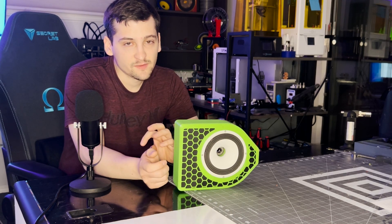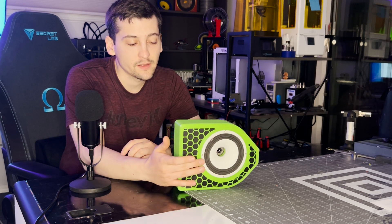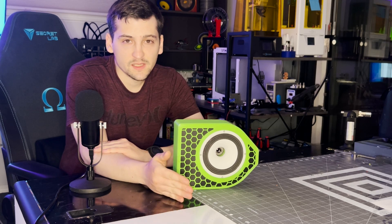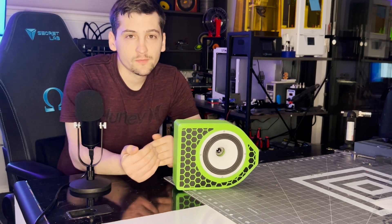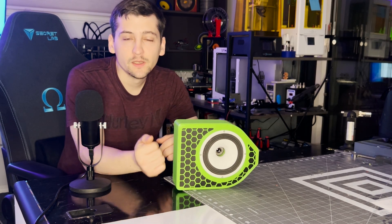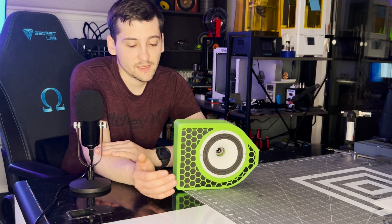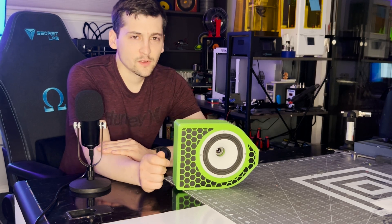I'm going to work on a couple different types of spiders. I like the flat spring design I'm using, but I'm going to try going back to a traditional spider using the foam TPU I've been using as surround, and see where that moves things for the TS parameters. I'm also going to play around with lengthening and shortening the cone, and changing the curvature — making it straight or more curved. Partly for ease of printing: I'm currently printing on resin printers, which is messy. I'd like these to be more accessible to people on just FDM printers.